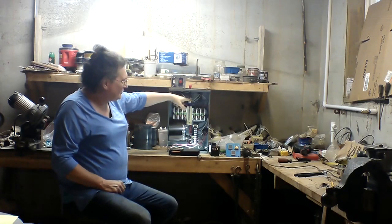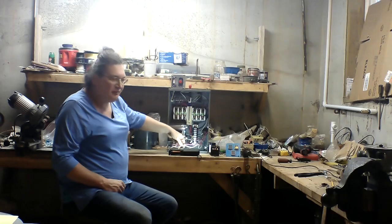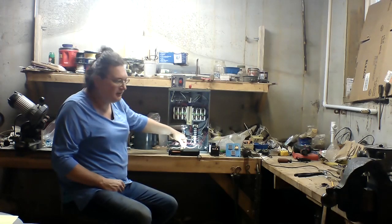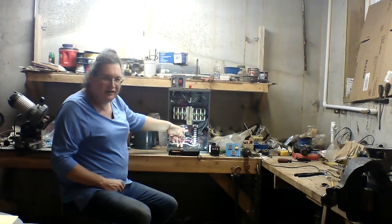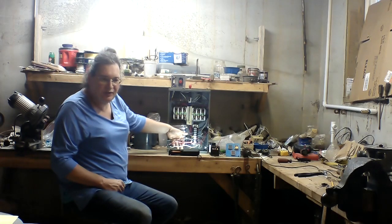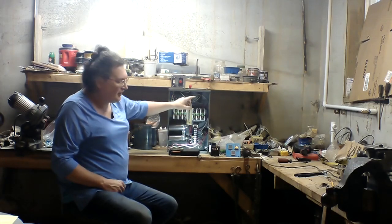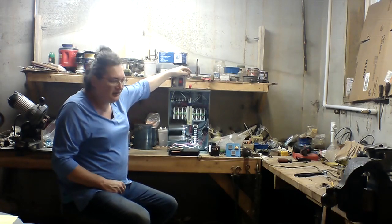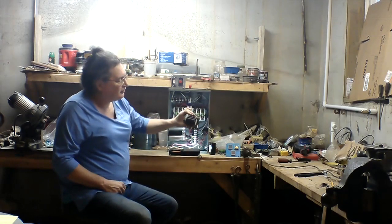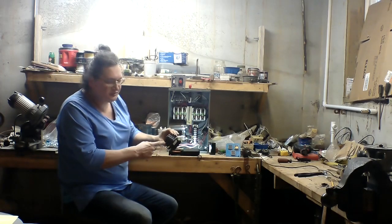I started off with a small relay. I forget whether that relay is 20 amp or 30 amp. I moved up my supply from 20 to 30 amp to try to help it. It helped a little bit going up to a 10 gauge wire; I was originally on a 12. But the relay, being a smaller relay, is maxed out, so I have found a much larger relay that can handle terminals with 10 gauge on each terminal.